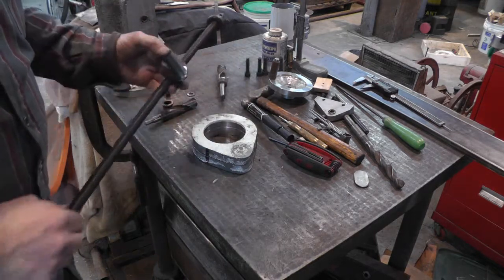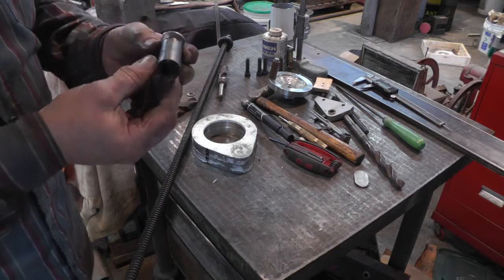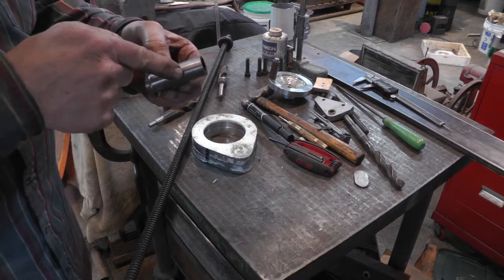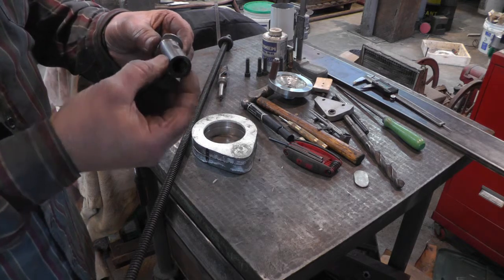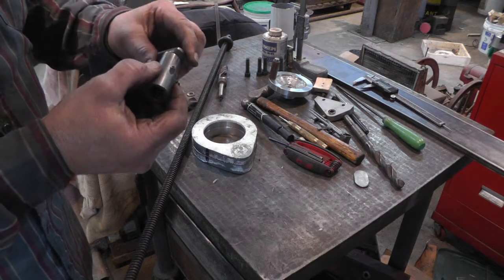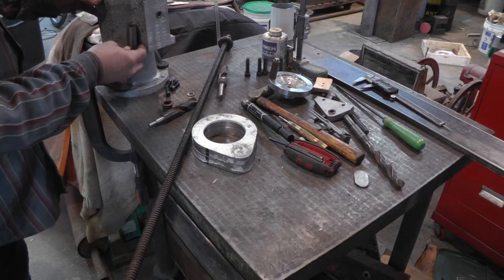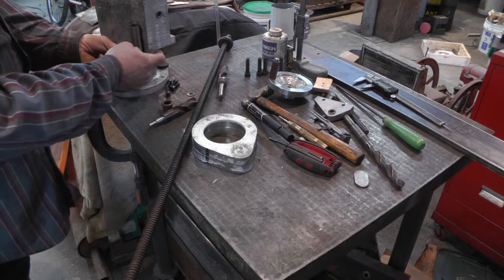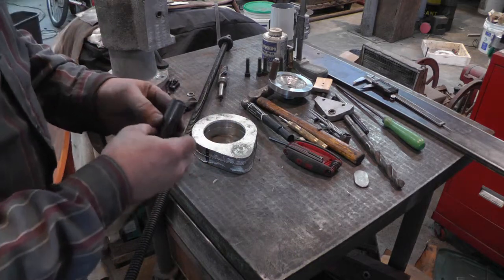and it had a hook on it that hooked someplace on the car. It's made out of cast iron, which is actually the nut, and I turned that down. It had a hook that stuck out like that. I cut it off with a bandsaw and I turned it down to 7/8 here. That's just where it cleaned up enough, and I left a little flange on it, and that's going to go in the bottom of this, and then the lead screw will go down through, and I'll probably use one or two set screws to hold it in place.